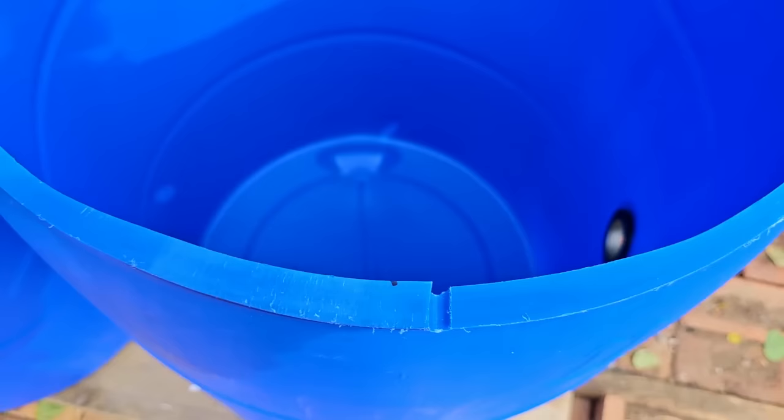The fitting on the outside will be glued, and this fitting here will make use of the hole already in the pipe. That pipe down there will draw out the bulk of the clean water so we're not wasting a lot when we clean the settler. The bottom fitting is just a bit of an extension so I don't really need to know the exact length of the pipe work. I'll grab a uniseal, some water from inside, pop the uniseal in at the bottom, then attach that drain fitting as well so I don't have to keep worrying about it. That's all in neatly now.